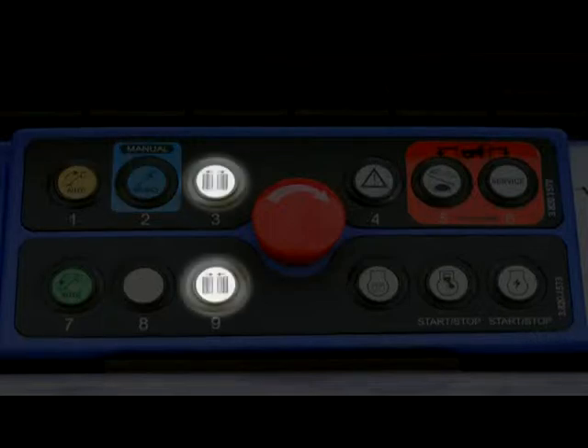The track width adjust buttons allow you to widen or narrow the tracks. To save wear on the tracks, only use this function when the outriggers are set or when the machine is traveling. Although they will adjust while the machine is stationary and its weight is on the tracks, it is not recommended. This feature is only available on the X550AJ and the X700AJ.